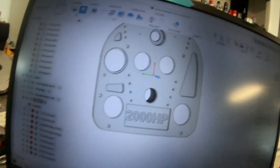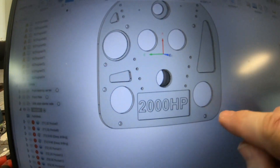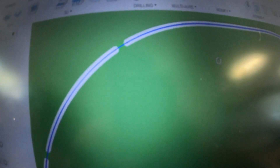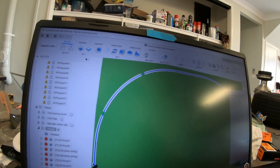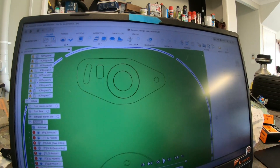Just working on this last program. I want to cut this out — I'm going to leave a couple of tabs on it so that once I cut it out, if I leave a couple of tabs around the perimeter, I can just crack them off after. That way I don't have to move clamps or anything like that. These are the tabs I'm talking about — tiny little tabs. I've only left them about 0.5 or 0.4mm thick, so you cut it down and it basically just stops and leaves those tabs. I can just crack it off afterwards, then just file those down.